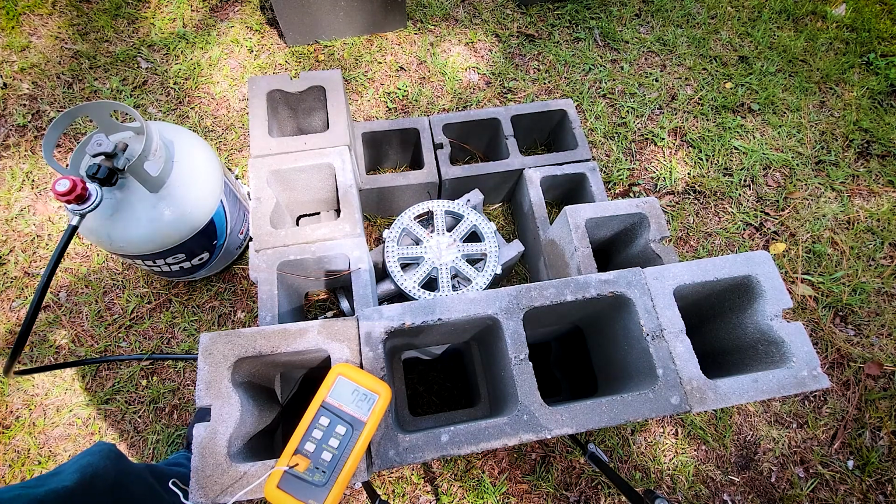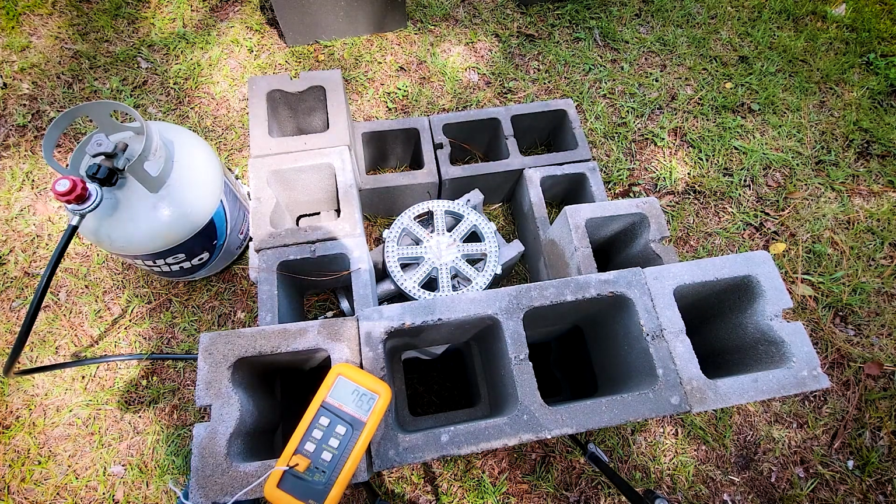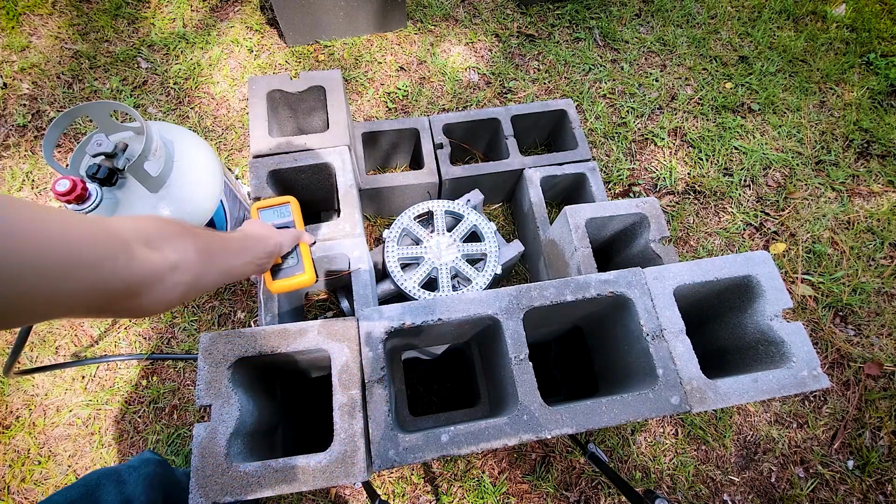So after a little bit more inspection, I figured out that the popping is actually caused by pre-ignition inside the burner. Basically, the mixture is too lean, so when the propane enters the burner and mixes with oxygen, it's hot and lean, so it just immediately goes off inside of the burner, and the flame goes out because now it's all burning inside of the burner. That's also not conducive for heat transfer or efficient burning, so it's kind of a problem. Thankfully, that's very easily mitigated just by making the mixture a good bit richer, and then it doesn't happen anymore.